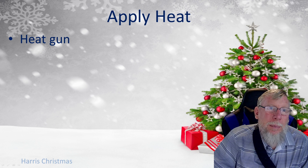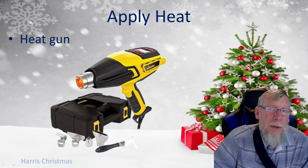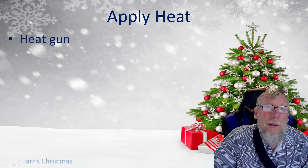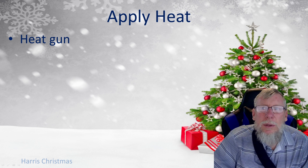All I did was apply heat with an appropriate heat gun and it worked. After that, I decided I only wanted to do it one time, so I bought a good heat gun with temperature settings. It also had a heat deflector to direct the heat, because I have melted a table I was using — you don't want to point directly down on a table that might melt. It costs about $65, but it's well worth it. I've used it for a lot of other things besides just solder sleeves. You can adjust the temperatures and know exactly what heat you're getting.